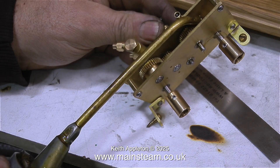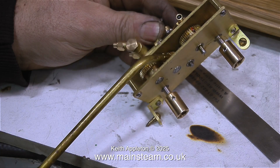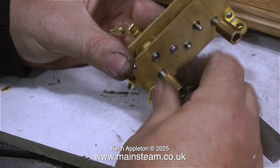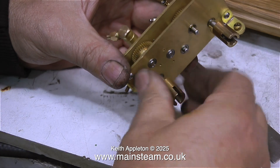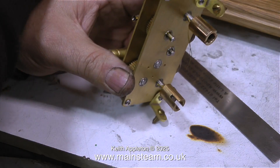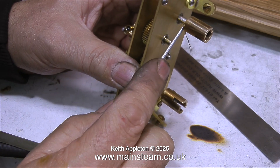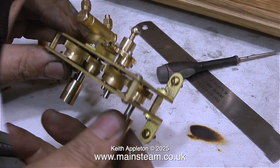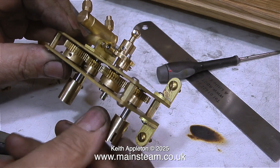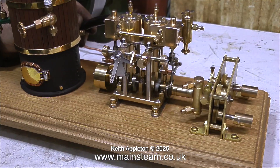Eventually the gearbox became very smooth — it's a really nice looking thing, if only the gears were made from phosphor bronze. Anyway, I gave the gears a good oiling with the oil mixture I used at that time, which was 50% steam oil, 25% three-in-one oil, and 25% rapeseed oil, also known as canola oil. You need to use the first pressing of this stuff. I was told by a scientist at an oil refinery I worked at for a while, fixing the computers, that rapeseed oil is a really good anti-friction additive — and indeed it is.